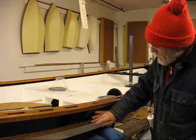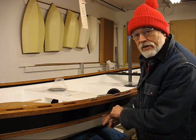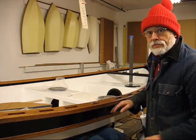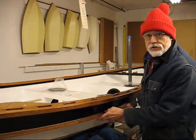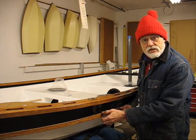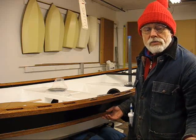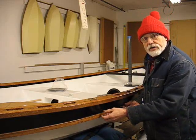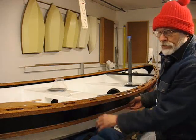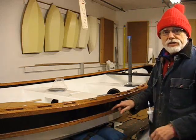I got it up and you can see the colors. I'm not going to hide some of the bleeds where I've got some touch-up to do on the finish on the rail here. I should not have put the trim on when I did. I should have used masking tape to protect the wood from the paint, so when I pulled off the tape I could put on the Gel Magic and then attach the trim. Wait until you're done with the painting.